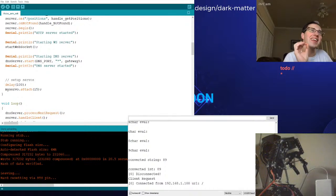That's the thing. If we were to interface directly with the ESP32 module from our browser, say that home function, we want to recenter everything. What that could do is individually send X, Y, and Z as separate packets. Then the Arduino is going to drop packets. I know it is. It's going to be busy moving the servo, and it's going to miss the other WebSocket packets.